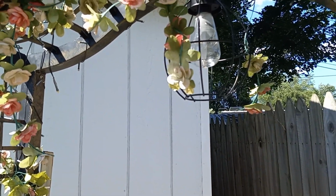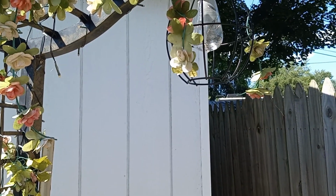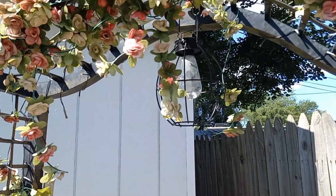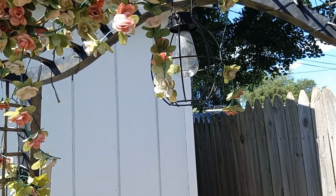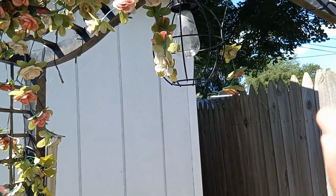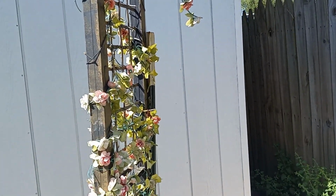I cleaned it out. I put some hot glue around the top to keep water from getting in there. Hopefully, they say hot glue doesn't work too well outside, so I'm hoping it's not permanent, that it's just to keep the water out for the season. And then, because that bulb is plastic, I put a hole in the bottom of the plastic with my soldering iron. So if any water gets in there, it's not collecting in the bulb, it's coming out. And I believe that's it.